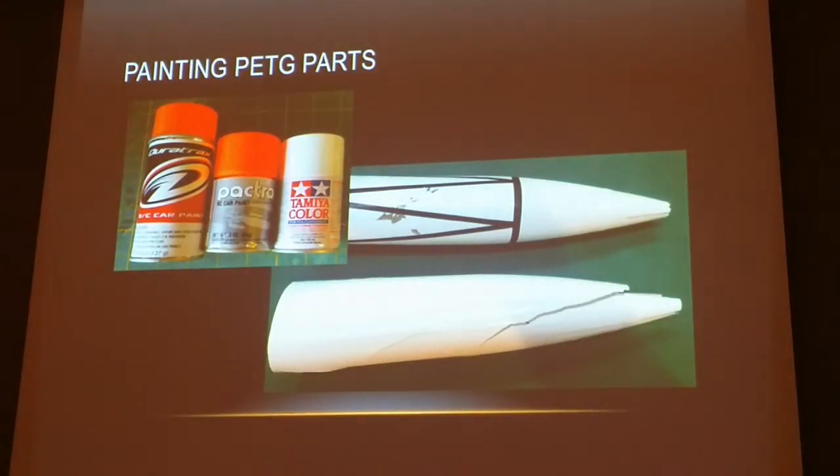Painting turned out to be a pretty big problem. I actually flew clear bottles in 2012 for altitude, and that was a problem because they were not as easy to see as they were supposed to be. We figured out one of the ways to do this — they used RC car painting for polycarbonate. PETG is not polycarbonate but it's related, and the paints work as well. On my V2, we used a primer fusion and it didn't stick really well — you would look at it and it would flake off. We went through the RC car paints, and unlike the RC car guys who usually paint on the inside, I painted on the outside for these models and didn't get any paint to flake off at all — including when I crashed one of the stages.